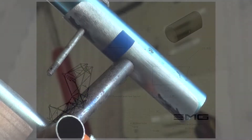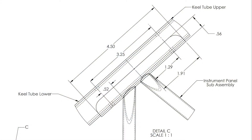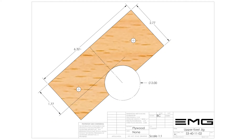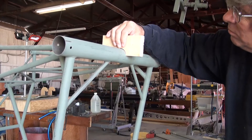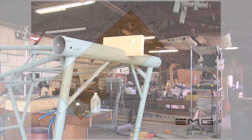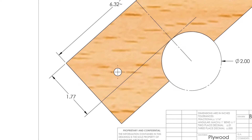Lay out and mark a piece of tape on the keel pocket that will be positioned onto the instrument panel bulkhead. It's best to use the reference from the keel pocket mounting hole. In this case, our reference from that hole to the aft edge of the instrument panel subassembly is 1.29 inches. Refer to drawing 5340-00-01 for keel positioning. Supplied with the welding fixtures is 5340-11-02, the upper keel positioning block. Optionally, you can replace this welding fixture by cutting a piece of wood to the thickness shown in the drawing, which is 1.77 inches, and use it in place of the fixture.